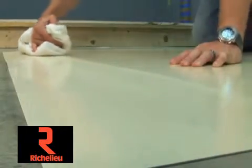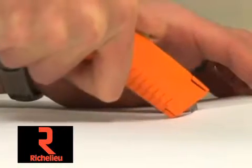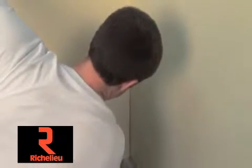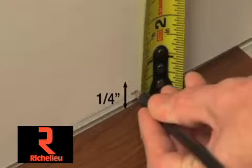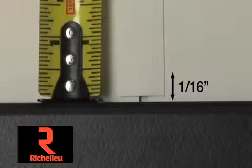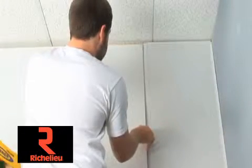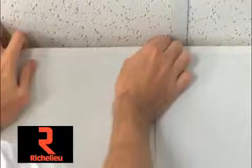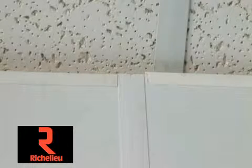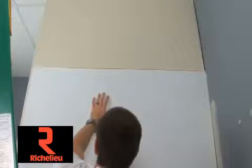Wipe the sheet back gently with a clean damp cloth. For non-full-size sheets, pre-cut with a hooked blade. Dry fit to ensure the proper size and keep a quarter inch minimum above the finished floor. Trim dividers are to be a 1/16th inch minimum above base moldings. If this is a wall-to-ceiling installation, pre-trim the top edge of the panel to allow for that 1/16th inch gap, then pre-apply the cap moldings to the panels prior to placement in adhesive. Strike plumb lines along the wall every four feet as a reference guide for panel alignment.